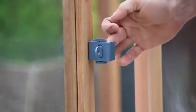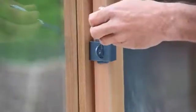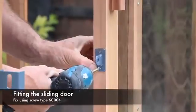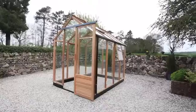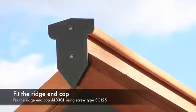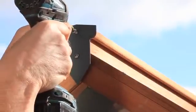Position the mating part AL3099 into the bracket as shown and slide the door into position. With a pen or pencil, mark the position on the door. Using these marks, fix into position using screw type SC004. The door assembly is now complete. Next, fit the ridge end caps AL30301 to each end of the ridge and fix in position using screw type SC125.